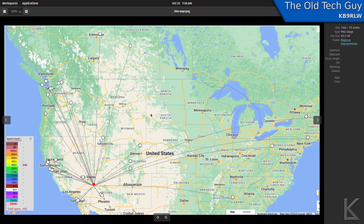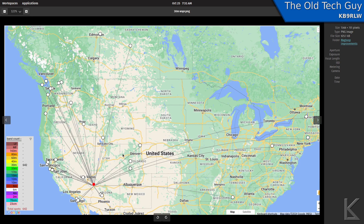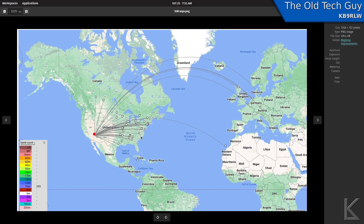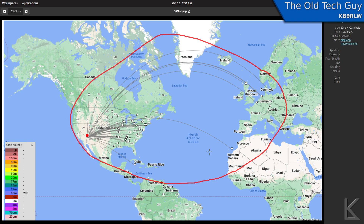What else? 30 meters — this was overnight, and our footprint is pretty good again. We got all the way out to the east coast of the US and up into Canada. I'm pretty pleased with that. But look at 10 meters — oh boy. This was inside the RV, and this was about midday. We got all the way over to Europe: Denmark, Austria, Germany, the United Kingdom, and some island off the coast of Africa. So that was 10 meters, half a watt, with the antenna inside the RV. Pretty neat.